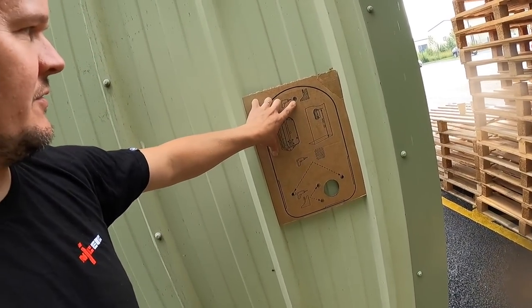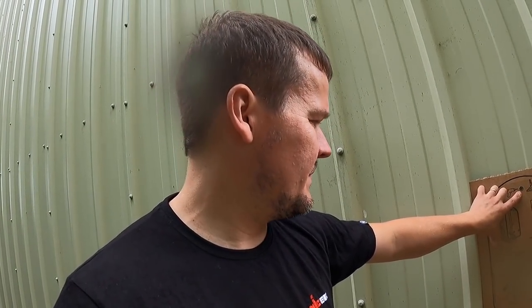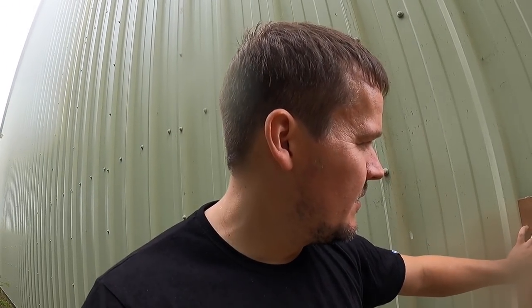So what I'll do is I've got some metal self tappers. I'll drill them out with a little 3mm, and then I can just fire the screw straight in with the impact, and then they've got the self sealing seal on them. So, but obviously I will set you up on the laps.